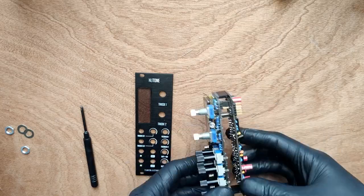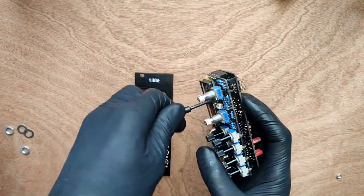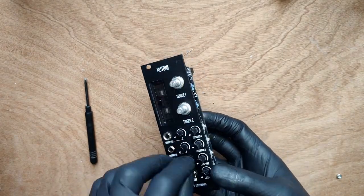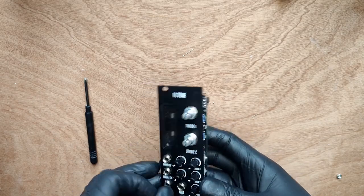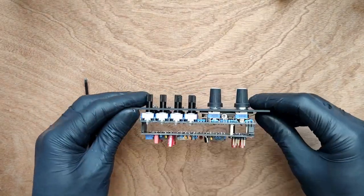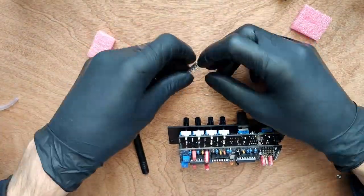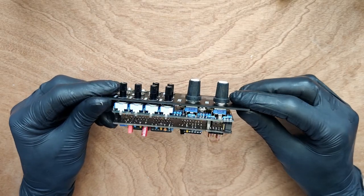Now it's time for final assembly. We used a spare M3 rack screw on the spacer, as the kit only included a bolt. This might have been a mistake. Turn the metal potentiometers counterclockwise and place the plastic knobs. Then place all ICs on the bottom. Flatten the legs on the table if necessary. Congratulations on your finished module.